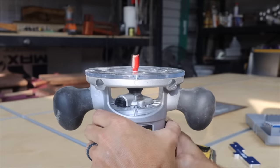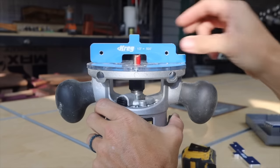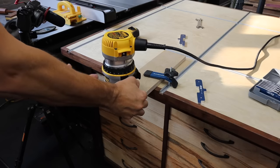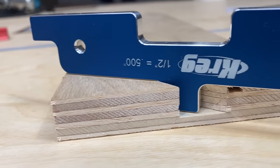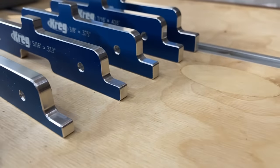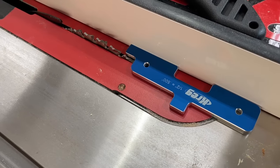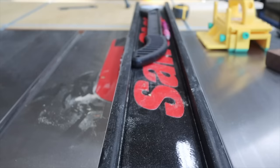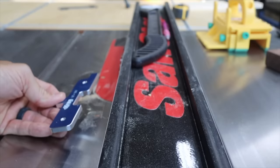You've got to hold the tape measure and you're trying to fumble with the router to get everything moved up and down. What I really like about these is they'll sit right there. You can raise your router until you get to the depth you want — anywhere from 1/8 inch all the way to 1/2 inch with this setup block. I've got it set at a 1/2 inch deep. So we've got a 1/2 inch and we can test that cut and it is exactly 1/2 inch. Another awesome use of these is they actually have a fence gauge right there on the end — that's what that elongated piece is. That allows you to set your fence depth, whether that be on a band saw, a table saw, or a router table. Now we'll be able to have a 1/2 inch cut there and that gives you a perfect setup every single time.